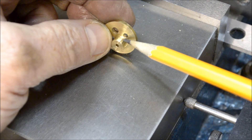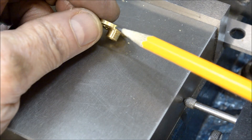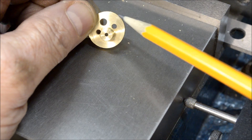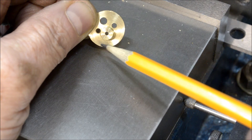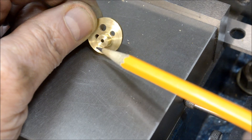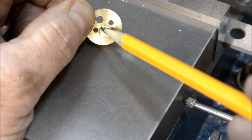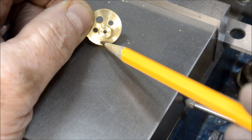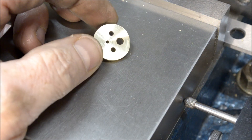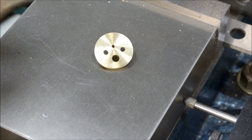So the head is done. What I did was I put this in a collet on the lathe and faced this down to a sixteenth of an inch. The only thing left is this has gotta get turned down to five-eighths diameter. But I'm gonna make the cylinder itself out of half-inch hex stock, and once this is on I could put the whole thing in the three-jaw chuck and then turn this down — it's got to be on the centerline of the whole piece, so there's no way for me to hold that now. The next time you see me I'll be working on the cylinder itself. Thanks for watching.